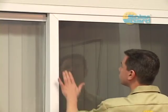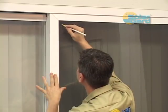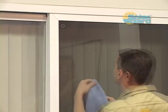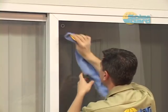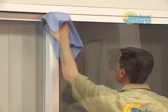Inspect the window for any contamination. Look closely for any air bubbles, water pockets, or trapped fiber under the film. If located, circle the film with your grease pencil. Check to be sure that no additional moisture has settled at the edge of the film by going over the edge of the window frame with your hard card wrapped in a lint-free paper towel or cotton cloth.